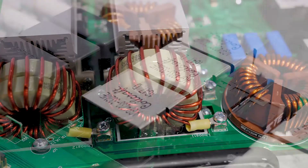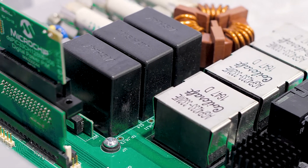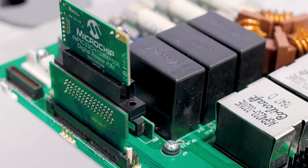It can take 200 amps. We test it primarily at 380 to 400 volt AC input, and it produces a 780 volt DC output to support the DC converter stage of the charging design.